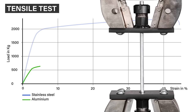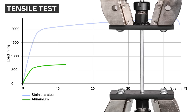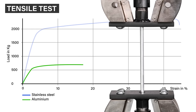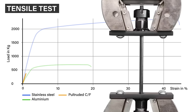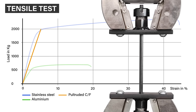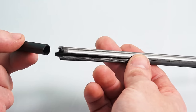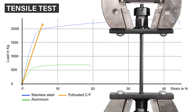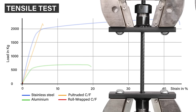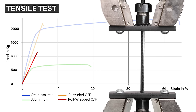These tensile tests were done without the extensometer that would be needed to produce accurate stiffness data, so we shouldn't pay too much attention to the gradient of these graphs. The pultruded carbon tube's line stays completely straight as the load passes the yield point of stainless steel, before continuing on to fail suddenly at over two tons — though it fails at the grip due to the less than ideal gripping method applying a sharp bite, so in reality it should take far more load.